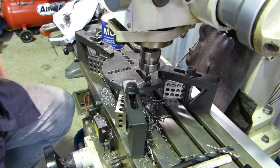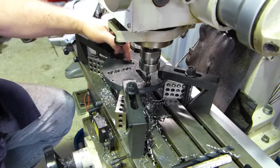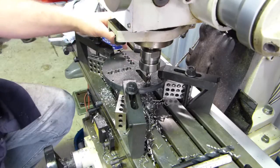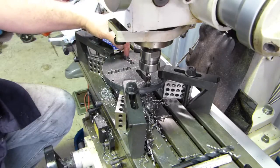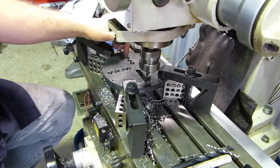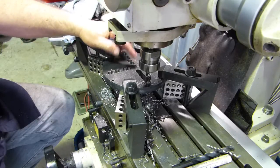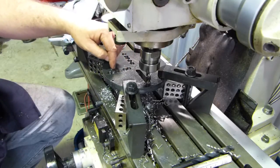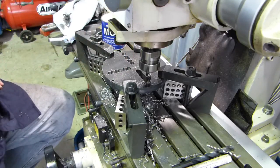One mistake I have made is by drilling these holes too close. When the drill actually bites into that open edge there, the drill kicks sideways a bit, and instead of just having a nice half inch run down through here to cut out, you actually have where the drill went. So in hindsight, I should have taken the time, instead of just popping a hole anywhere, which is what I did, I should have spaced them so they didn't touch each other, and they would have been a bit truer. But anyway, we'll putt along with this, and I'll come back to you in a little while.